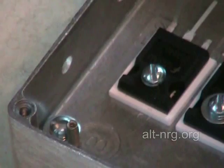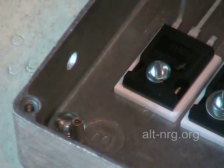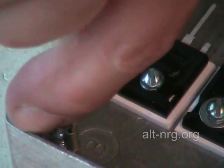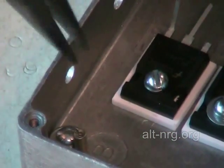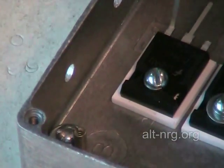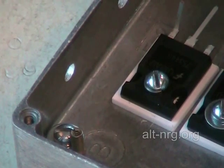With a pocket knife, I happen to know that the opening of the end of that ring terminal is not quite big enough to fit both terminals for C5 and C7, so I'm just going to open it up just a little bit more by running my pocket knife down into that slit, and I know that's going to be big enough to fit my components.